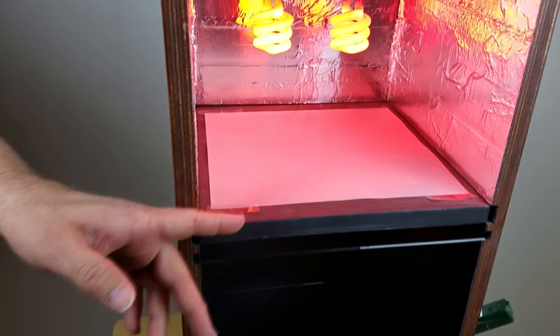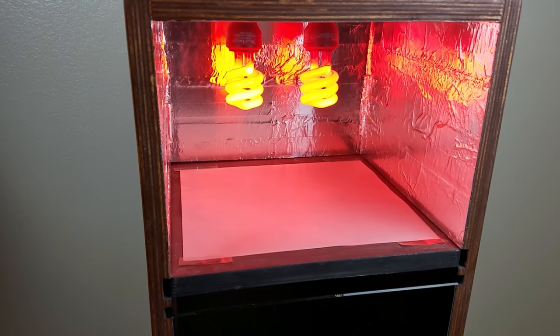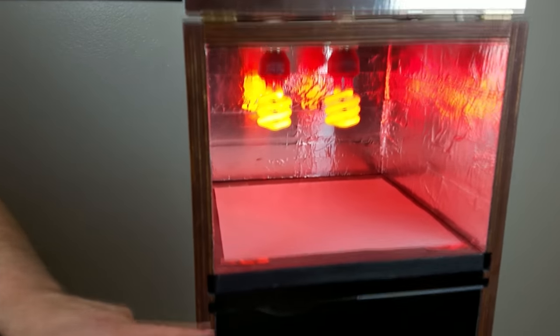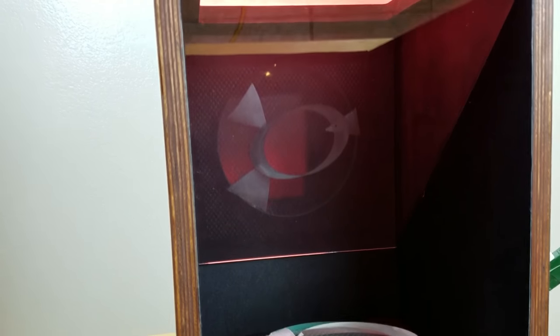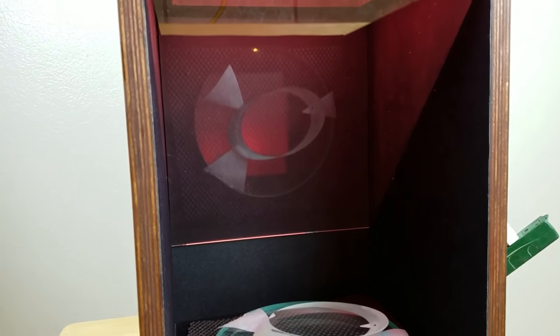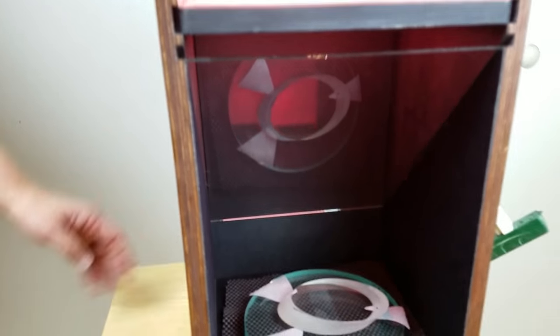The diffuser is just a piece of plastic from a hobby and craft shop like Michael's. The whole key to it is a plate of glass that runs at a 45-degree angle. That plate allows the light to come through the top of the box, down onto the mirrors, then back up to that plate of glass, where it gets reflected out so you can see the interference bands.